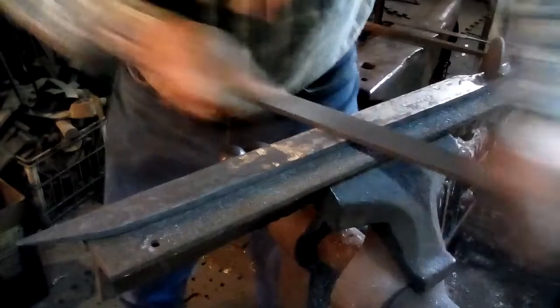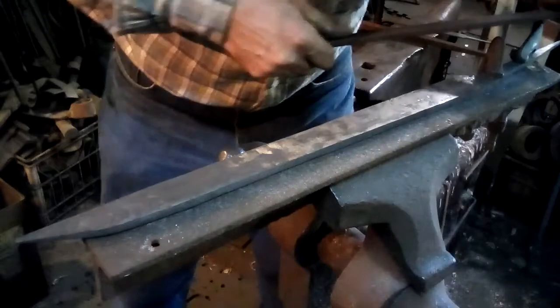Even though there's not much carbon in there to begin with, by the way this was welded and processed, some of the skin basically got case hardened in the fire. The outside parts of some of it absorbed more carbon than others, and after it got re-welded a couple of times, those skins get distributed and they actually stay as carbon lines, so that when you file through, you'll see some layers are a little different than others.